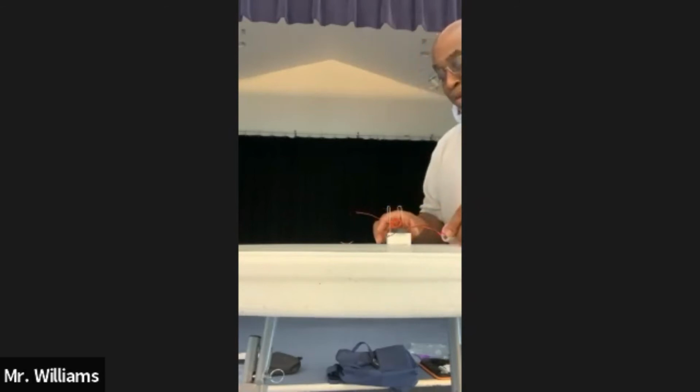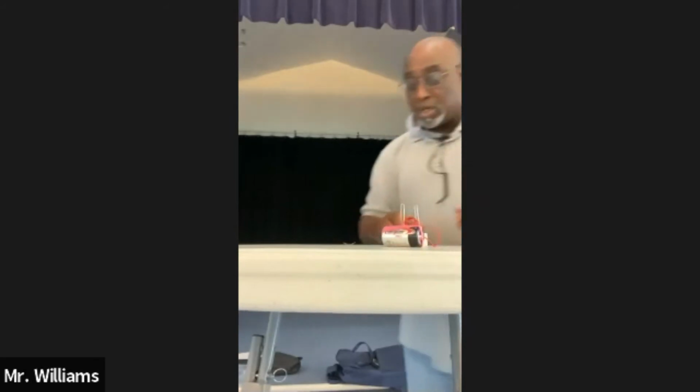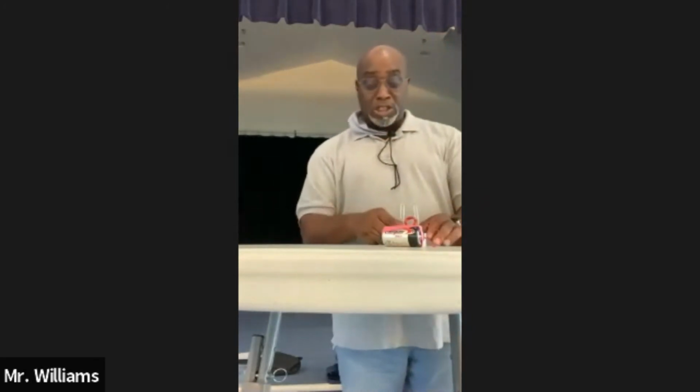Now, in a perfect world, unlike the one I'm experiencing right this minute, your motor will immediately start spinning. If it does not, what do you check? Well, you want to make sure first and foremost that the magnet is not touching anything, including your coil.